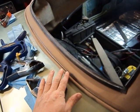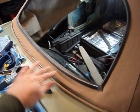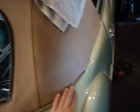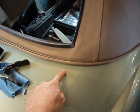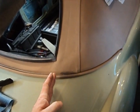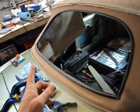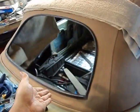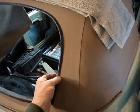We're sort of back to square one here — this is all loose and I started tightening it down. Everything's looking nice. There's a cable that goes around this rear window and it connects to a bolt, a plate back here and a plate over there. The second I put this tension cable in — just one thread on each nut, both sides — I fastened down the top, tried to swing the rear window in and it won't go. So this tension cable is what's causing the problem.